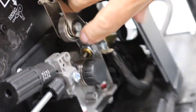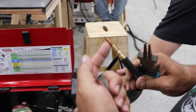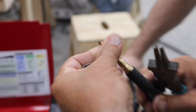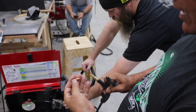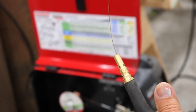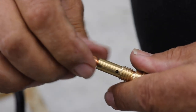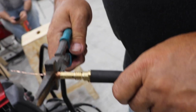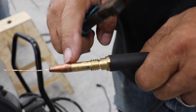Make sure the wire is in the groove — if it's not tracking in the groove you won't have good feeding. Take the nozzle off before you feed the wire through; you don't want to bird-nest it and have to start over. Feed it right out, then get the tip back on. Make sure the contact tip is bottomed out and tightened all the way — that's where the connection is, where power transfers to the wire.